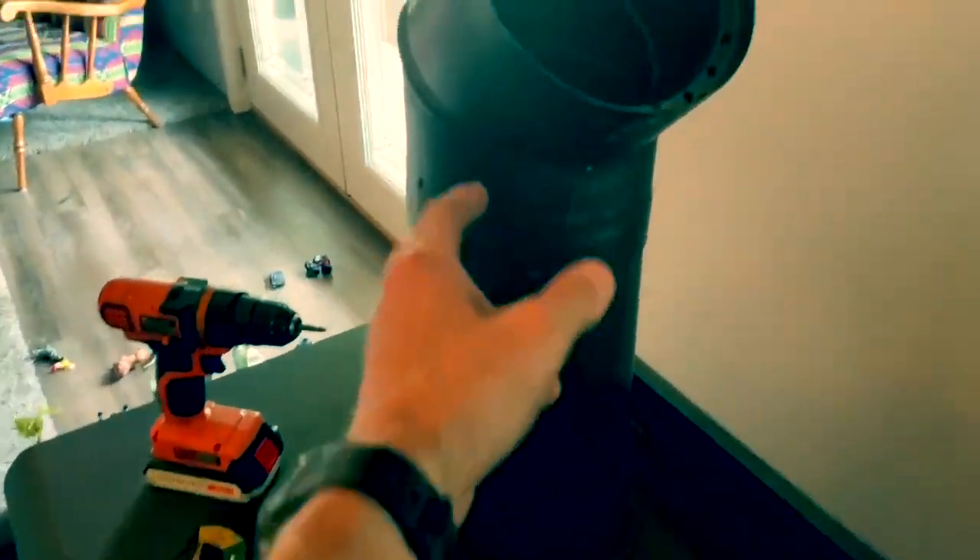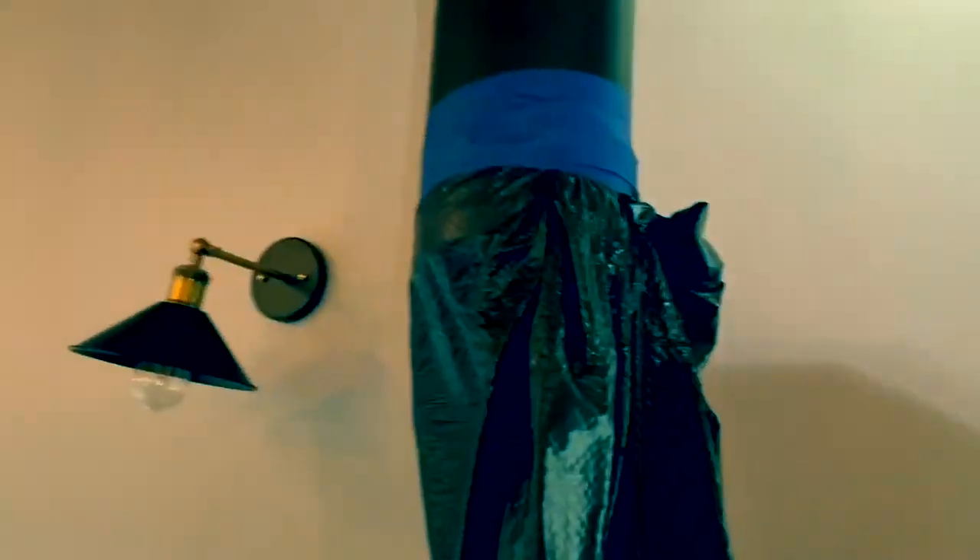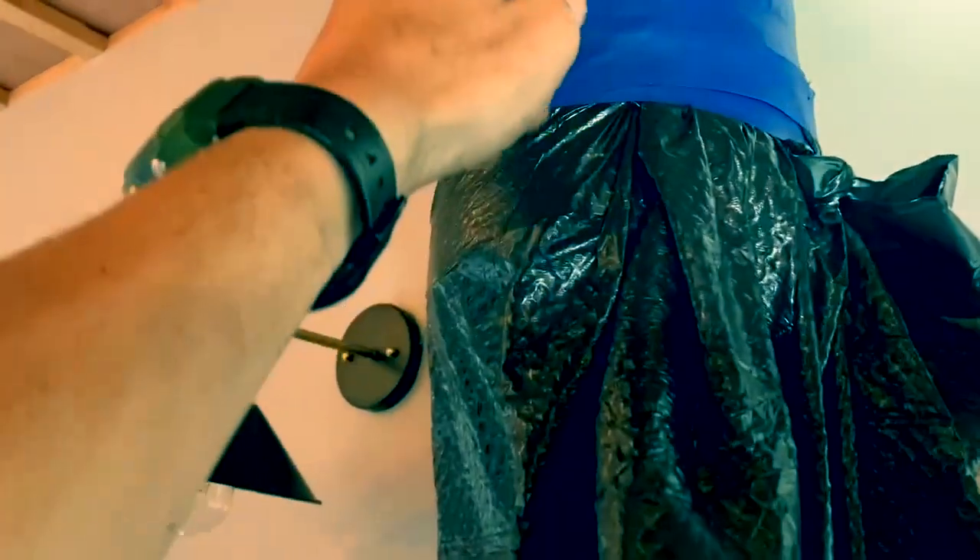This job total I think is going to take less than 45 minutes. We've got one piece back installed. I'm about to take this next piece off. You want to make sure you tap on it and get all that you can out of there, because you don't want a bunch of nasty creosote dropping all over your carpet — your wife will not be happy. So I'm going to clean that up and get all that's in the pipe into the bag before we take the bag off.